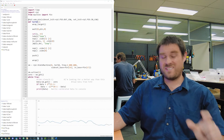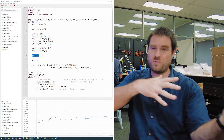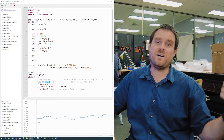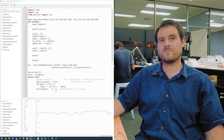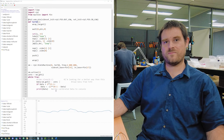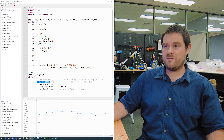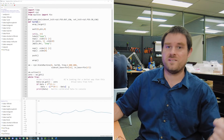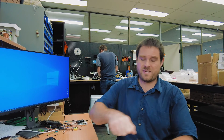The state machine has a small FIFO buffer inside it. A push inside the PIO code takes whatever's in the state machine's input shift register and pushes it into the FIFO. Then in your Python code, a get call pulls the data out of the FIFO and into your Python code. Our infinite loop gets new data from the FIFO, performs a simple two's complement conversion because the ADC output is 24-bit signed two's complement format, and prints the raw data. For real SI units you'd need to do your own calibration for whatever load cell and mechanical arrangement you've got.